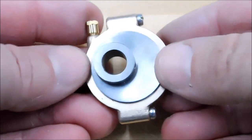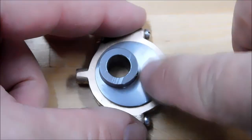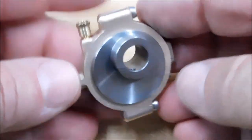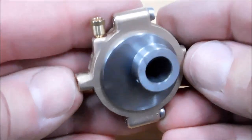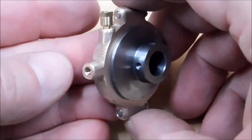Don't put the hole in at all. You know you're going to go to the mill to put this feature in right here, right? That little set screw hole, grub screw. Clamp it down, indicate the boss, drill and ream it in the mill. Problem solved. Anyway, that's my take on it. And don't be afraid to try things that scare you. And if they do scare you to the point where you don't want to try them, then don't try them. Good piece of advice for keeping all your fingers and not screwing up somebody else's machine.